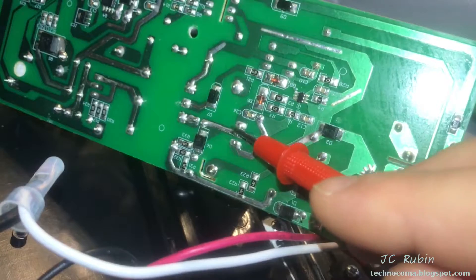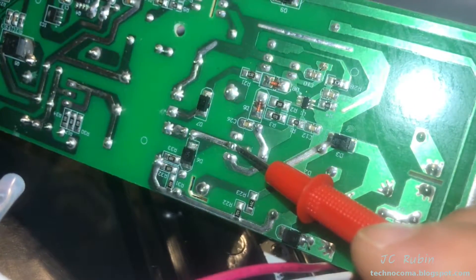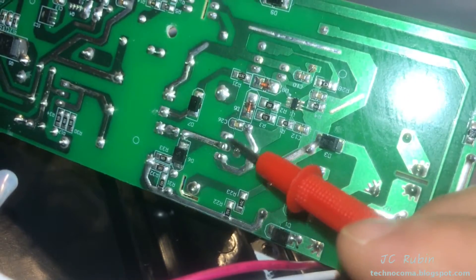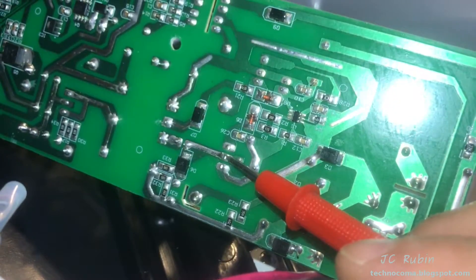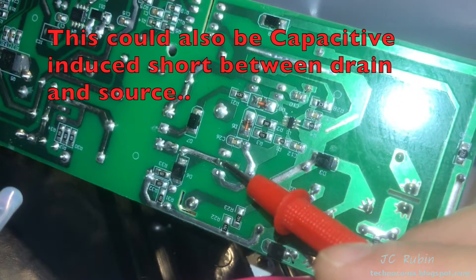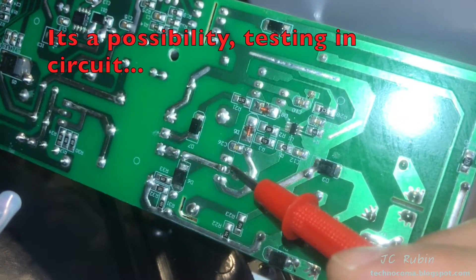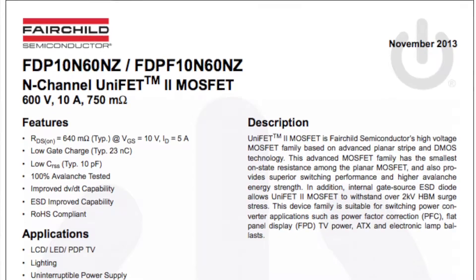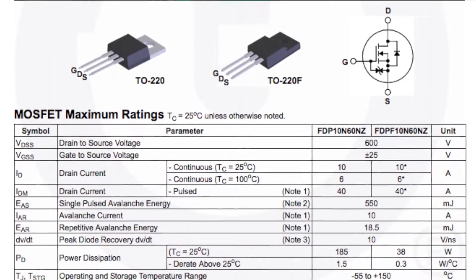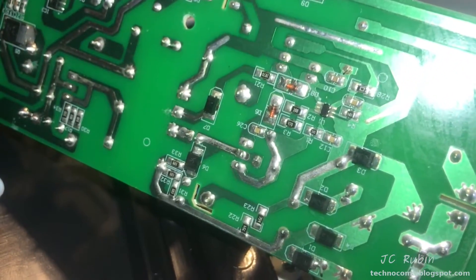We can see there is no direct electrical connection between those two points. This is in-circuit, so that possibility exists, and I still have to return this unit for warranty so I can't fully tear it up. I measured the resistance between drain and source and found that they are in fact shorted — this should be open between drain and source on a working N-channel MOSFET. This is an FDPF10N60Z from Fairchild. I looked it up — it's showing the same voltage across because it is internally shorted. This appears to be the component that has failed.